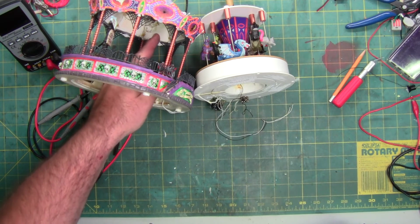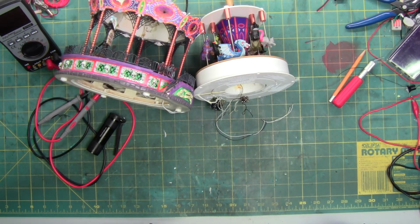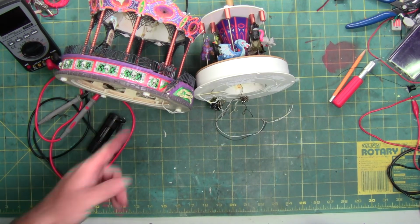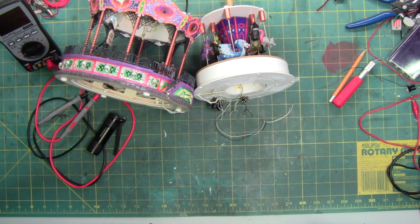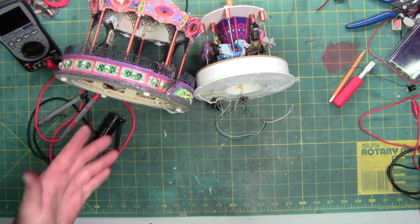Because the chip they use in here, in this blob chip, is somewhat proprietary. I have tried finding them. I have tried scraping that stuff off the top of it and the previous one with no avail. There are some other circuits out there that can do the same flip-flop, but they pull more than 4.5 volts of power. Somehow, Lemax uses a 4.5 volt input for the chip that it says runs at 9 volts. So I know it's not the same chip that I'm finding online. So I'm going to try and doodle some circuits and build a couple things and then plug it in and see how it works.